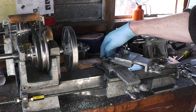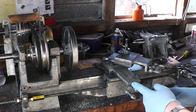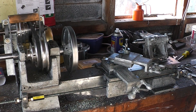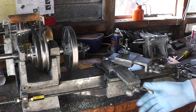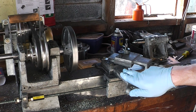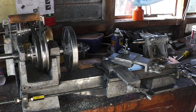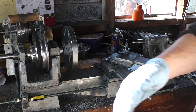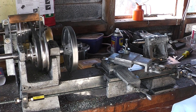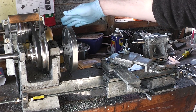This is your first bit of having to measure twice and cut once, especially when you're drilling through the tongue and then through the casting. If you're able to find a drill press with deep enough travel to drill that through hole, I highly recommend using your drill press, because that will help you get a nice straight drill — not one going down at an angle or off to the side. Because if you go off to the side, you're going to hit the screws in the ways; if you go up or down, you'll either hit the ways or hit the casting.